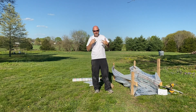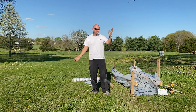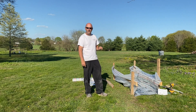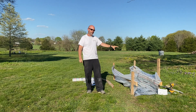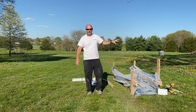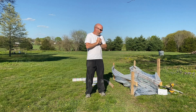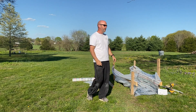I'm going to play a couple of older videos first — the audio may not be perfect since I didn't have a mic — but they show an actual pour so you can see how it fills up. It seems crazy that this fabric would hold back concrete, but I've been hired a few times after somebody got their butt kicked on a footer and was scared to pour their walls. The walls are actually the easy part; footers can really get you into trouble, and this system fixes basically all the issues you'll ever have with a footer.